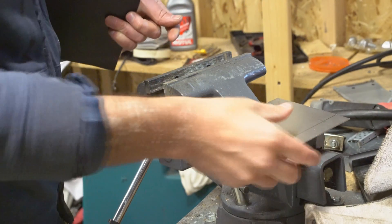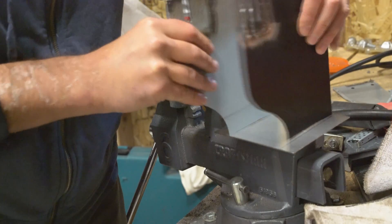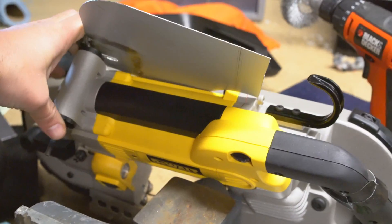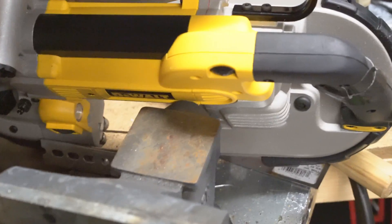And now this is the base plate — that's what I cut before. This is actually a bit thicker, which is nice. That's going to sit right on the edge of the wood and then we're going to have stiffeners in between. The best way to set a lot of this up is to use what you can as a template. Templates are really good rather than just measuring with a ruler — there are a lot of places you can make errors and they accumulate. So if you can attach stuff and tack it, you know it's going to be a good fit for real life use.